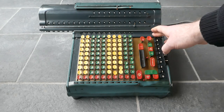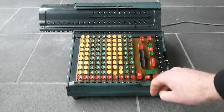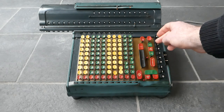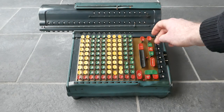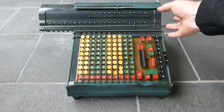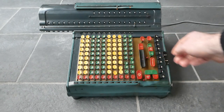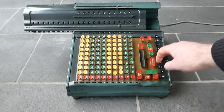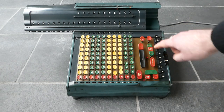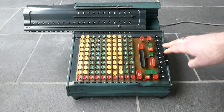This is because by default pressing one of these multiplier keys will shift the carriage to the right. You can however also do it in the opposite direction. I can change to shifting to the left by pressing this green arrow button. Now pressing any one of these multiplier keys will shift the carriage to the left. So if I want to multiply 1234 by itself, I can just enter 1, 2, 3, 4 like that, and the result is shown here. So these green arrow buttons change which direction the carriage is pushed after you press a multiplier key.